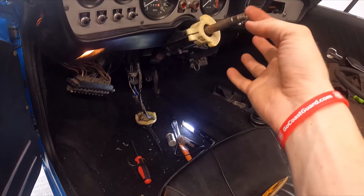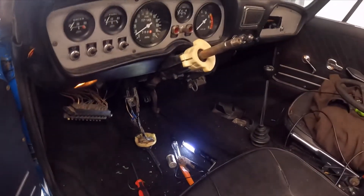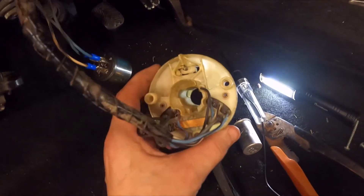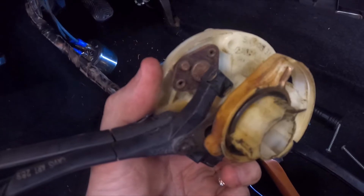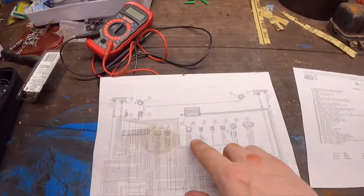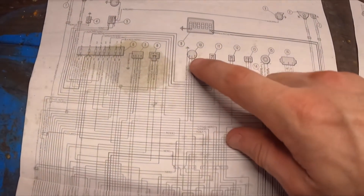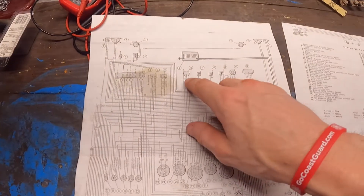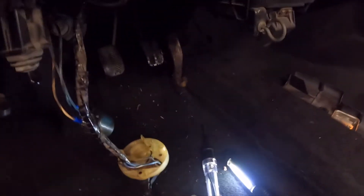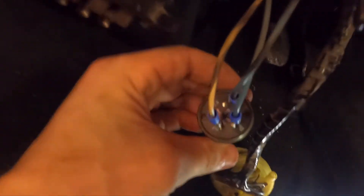So we've got the directional indicator column part off, and I brought my test light to it. There was no power coming into the black and white wire on the top middle there — no power going in, which corresponds to our direction selector. So what I did is I went back to my wiring diagram here on the bench. I saw plus, L, and P — I thought it was an L and R. I go back and look at our new relay, and I realized that it's not an X, it's a plus. So there's a plus on the top, a P, and an L. I rearranged the wires — let's see if that'll solve our issue.